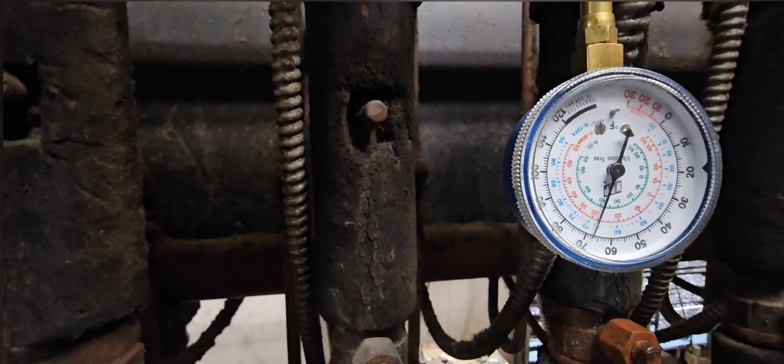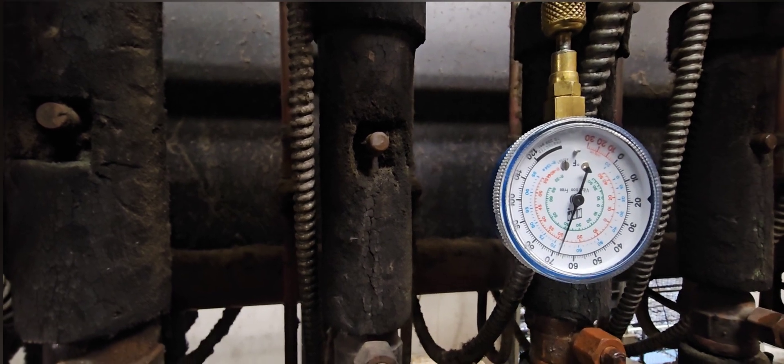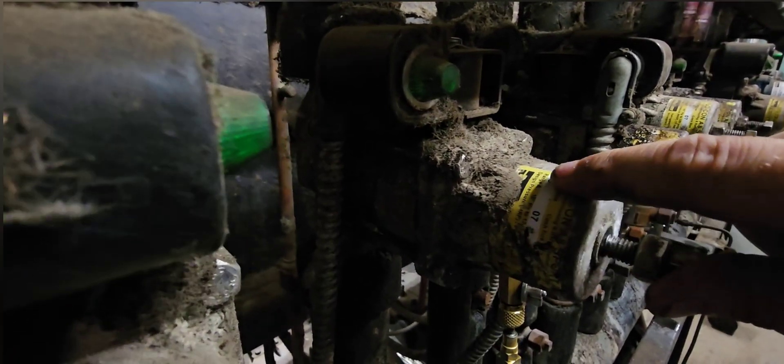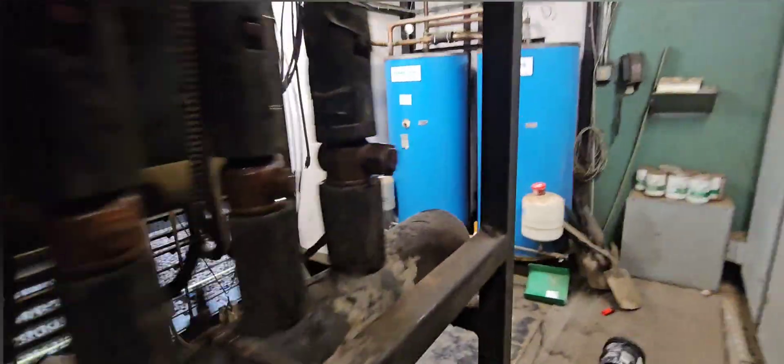We're still at about the same spot — now it's coming down a little bit. Yeah, this thing's acting funky. I'm going to give it more time. The store just let me know about another case running warm, so I'll go downstairs and look at that while this thing adjusts, then look into replacing this with a new one. Let me check the valve size — it's a 5-7, so port size 5, pipe size 7. It's already pretty small — it might just be sticking.